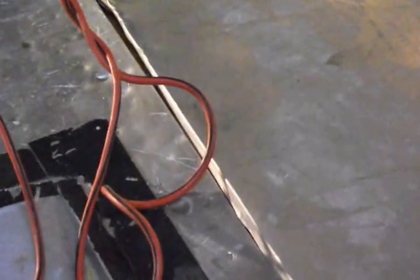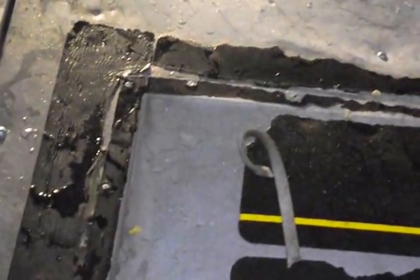Here's your hammer — we're going to cut off some of the lip. It has a lip that slides down in, and we're going to get all this together and have a good looking cooler when we're done. We're starting to lay our first piece — here's our first piece of aluminum plating. We've got our first piece laid. Now we're going to rivet it all the way around the outside edge at about every 8 inches, and then about 12 inches in the field. Then we're going to criss-cross it and put a little piece on our first piece.